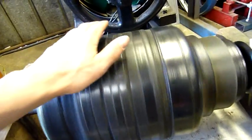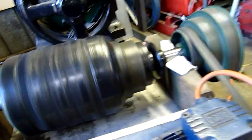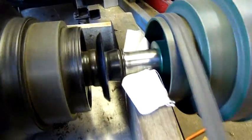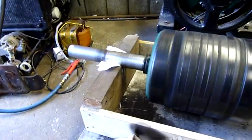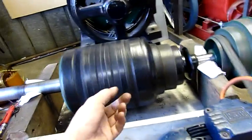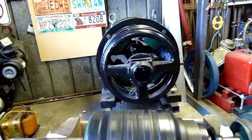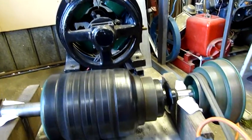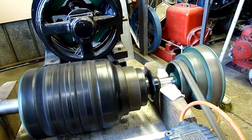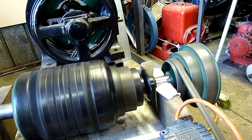It's spitting out air through the slots, particularly the center, and then the air just moves outwards. There's a little oil slinger thing brazed onto it there. I'm impressed. It's running at 50 Hz so the motor's doing 1400 RPM. The rotor's doing pretty much as many RPMs as it wants to in the housing — its maximum speed is about 800 revs, and at light load you generally won't even have to spin it that fast.